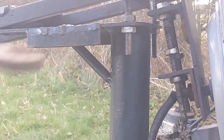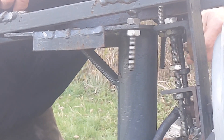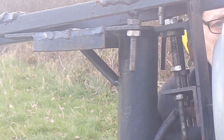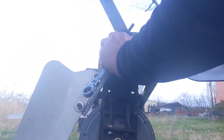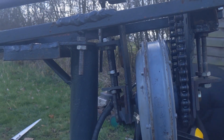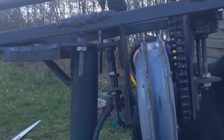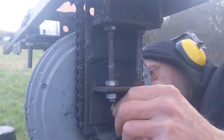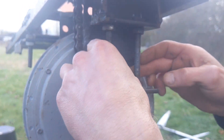Now the chain's gone super tight. I'm just going to lower it down a bit because we've got these nuts so we can change the angle. Tighten them up now in case I forget later. That's way too hard to turn. That feels super easy to turn — getting nice and tight there. We should be in business.